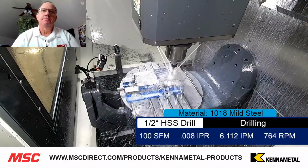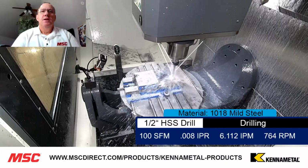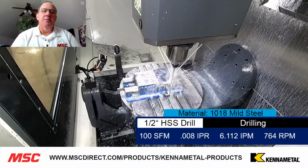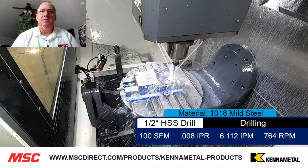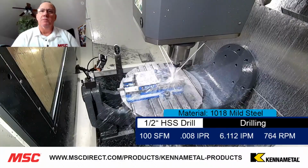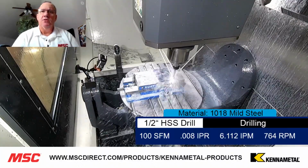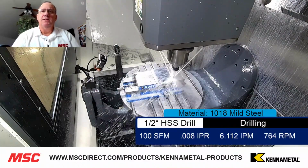And as we ask about the other types of drills, what type of tool life are we looking for with this specific tool? Well, a high-speed steel drill, not the best tool life, that's for certain. It'll fluctuate depending on the type of material you have. You can see there the chip stringing up on the drill and slinging off. That's another issue with high-speed steel drills: it's not very good for chip control, so it can cause a lot of different issues. Heat gets in there. So the tool life typically varies on the different types of materials you may drill, but typically not a really good tool life by no means.